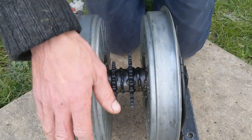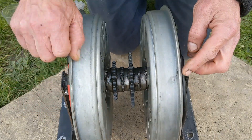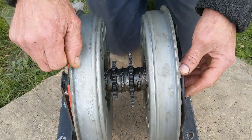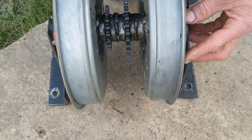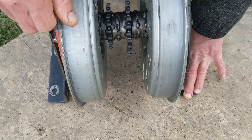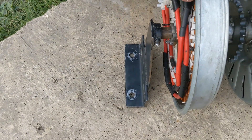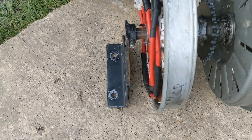I've got the smart drive generator on the floor and I just wanted to show you the main problems with it. The first one — and all the problems are due to the welding — is just here where you'll see it comes out and goes in quite a lot, whereas the right-hand one is pretty straight. So that's the first problem.